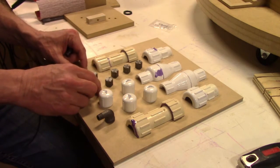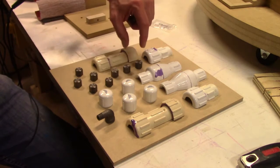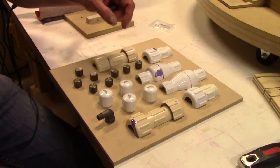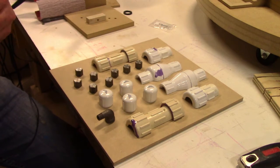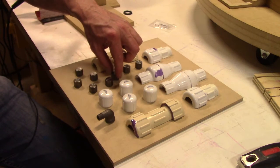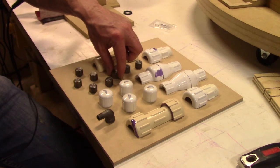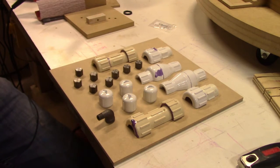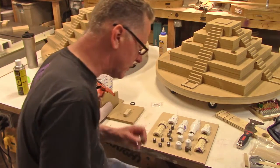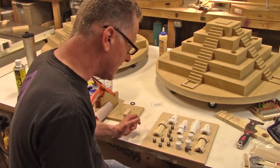As I'm arranging these parts, what I'm trying to do is make sure that I've got a really substantial margin between bits, because some of it's fairly deep and some of it's kind of shallow. I want to make sure this is going to be a really robust mold, so I don't want to give myself just a quarter of an inch of silicone between parts. That would make an okay mold, but it wouldn't last as long. I don't want anything that's going to tear, and this thing is going to sit around the shop and get beat up.